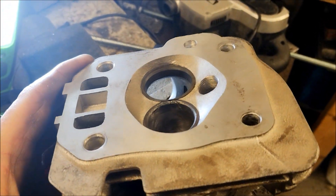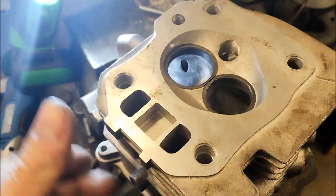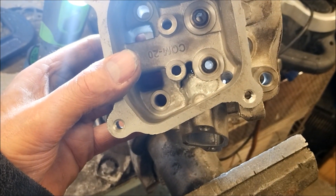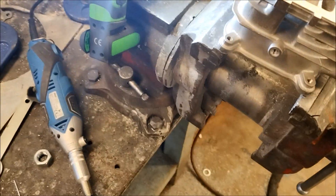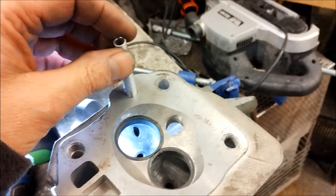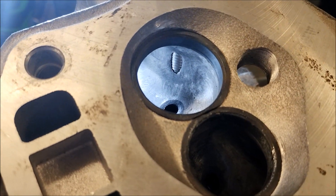Today is pretty much the last day before I go back to work. This is the inlet chamber - I went through two places there, as you can see the hole just there. I did fill up the area but you can see that light in the little corner, so I'll just put JB Weld on that. This is the one they say you're going to break through all the time - the oil hole. I've actually machined and put some ribs on it so it will stick. I machined a little tube which will go through it and that will be JB welded in as well - you can see it just fills that hole up nicely.